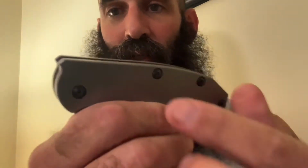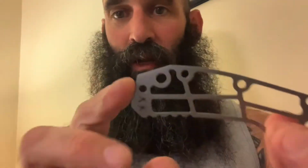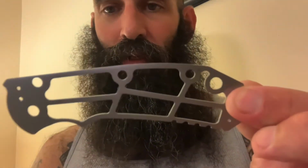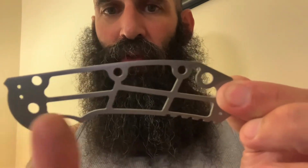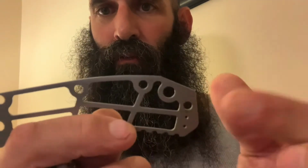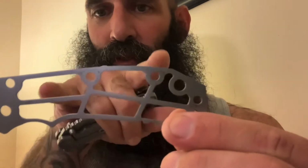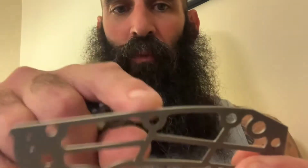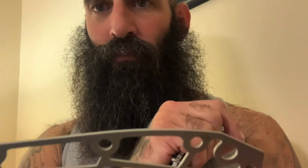So essentially, I did the inside of this scale. You can't see the stop pin, but I did it first. That creates the hole locations. And then I basically took this part and flipped it. I'm doing all this on the aluminum fixture plate, basically. I went ahead and drilled and tapped 832s for these 4 positions, this position here. And then I also counterbored this position and this position for gauge pins, so I can locate this part on the fixture, and then clamp it with 2 bolts here, undo my pins, and put my other bolts in there.